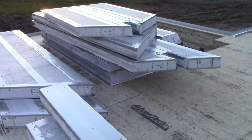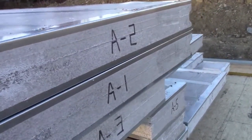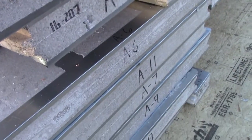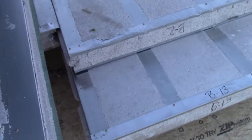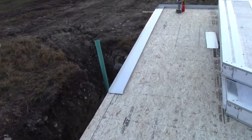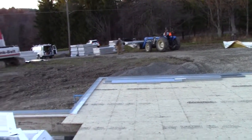There's a lot more panels up here now. As you can see, we're just stacking them in piles based on how they'll get assembled. Walls are categorized by letters, and you get all the pieces to those, and then after that you go just by the number. There's a sheet that lays out how all these are supposed to be fastened together. We got quite a few of them up here, and I'm just finishing up putting down this last little bit of track, putting great stuff underneath as a sealant, while they're bringing more panels over.